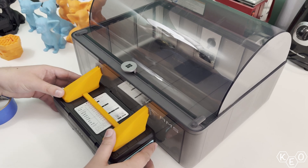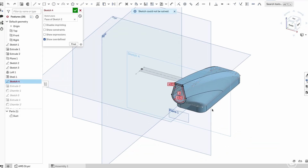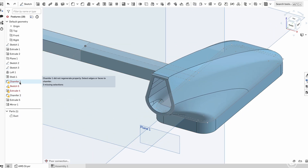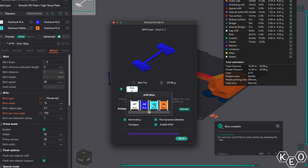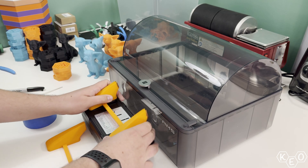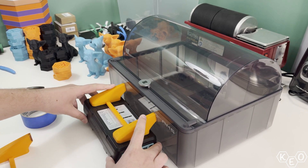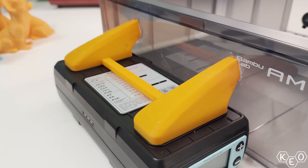The only thing I was able to glean from the initial test was that the ends needed to protrude into the box a little more, so I moved on to version 3 of the duct. I took off the little hooks because they didn't really do anything for me, and I made the ends stick into the box a bit further. The taper the shape has naturally creates a kind of interference fit with the holes I cut out. Again, not a perfect fit — no gasket material — but definitely good enough to prove the concept.